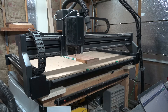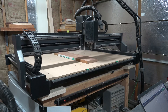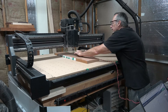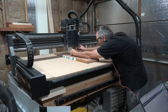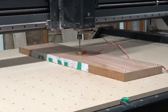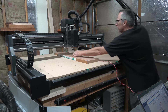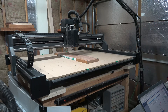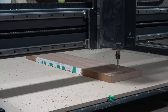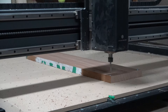From the home position, I can jog the machine to the right 24 inches, which places it at the center of the workspace. Then I'll jog it back 24 inches on the Y axis, which puts the center of the spindle directly over the very center of the workpiece. That's where I probe the bit to tell the controller what the Z axis start position will be. From there I can numerically jog the spindle to the X, Y, Z start position and send the G-code for the first carving operation.